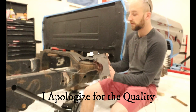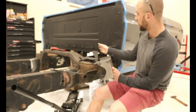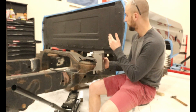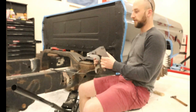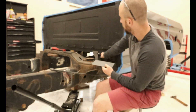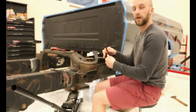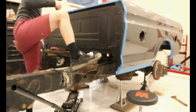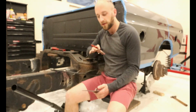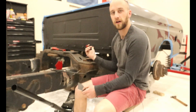As you can see from the completed body mount, this piece that we cut out is a little bit taller than the actual body mount needs to be, so we brought it over here to adjust the height. There's a steel plate resting on top, so I have to account for that when I mark my height. What I'm going to do is crawl underneath the truck, take this eighth-inch piece of metal, place it underneath the cross member up against the upright, and scribe a line underneath — that will show where I need to cut and it factors in the top plate as well. That side didn't work quite as nicely but we did get a mark, and I can use my speed square, trace that line, cut off this section, and run it around for a test fit.